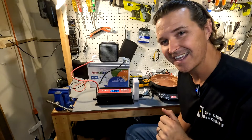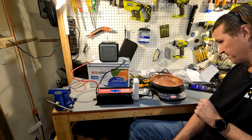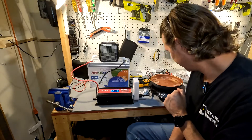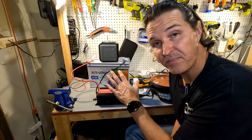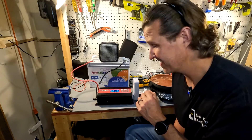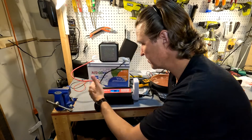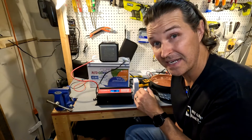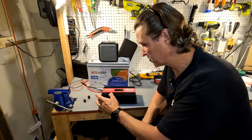My water is starting to boil, so I'm going to push this up to 1300 watts to see if the overload protection kicks in. After about three seconds the inverter shuts off — perfect. The inverter turned off all power, then turned back on after about five seconds. That's good and bad — I feel it really should stay off longer. I do like that the fan continues running afterward, since it kicks on when the case is over 103°F and it's definitely over that.